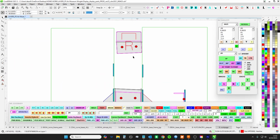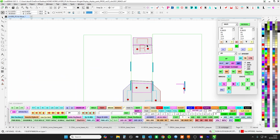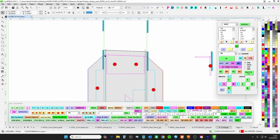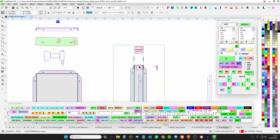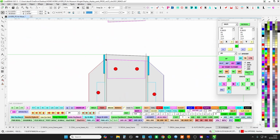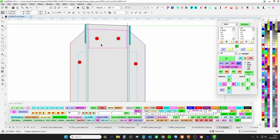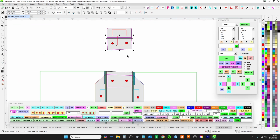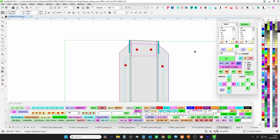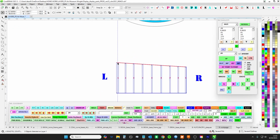Now, in order to get the top on, I made a little tray. So you're going to bend these guys up and you're going to tack these onto here. And it's going to be a little support tray for the top lid, the 1/4 inch. So you can see here, you're going to cleco that on, bend that up. It's going to be at an angle, and then it's going to sit there. Now this one, you'll want to overcook it, but you could bend it by hand, but it's definitely going to have to match the bend, this angle here.